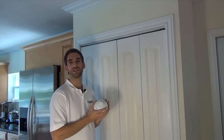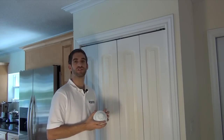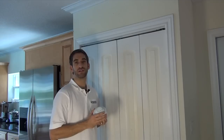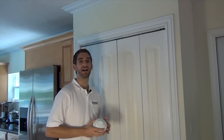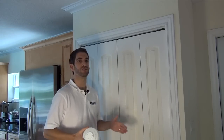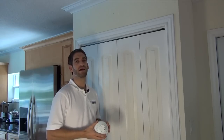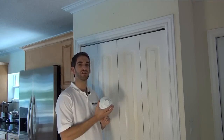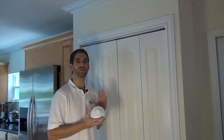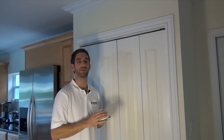The 5809 is a great sensor to use in the kitchen because instead of the 5808W3, which is a smoke and heat detector, this is a standalone heat detector only. Therefore, in rooms like the kitchen where you may have smoke when there is not a real fire, you're not going to get false alarms. So if you're cooking, you burn something, or you just open your oven and you get a lot of smoke, if you had a smoke and heat detector in the kitchen, you would have a lot of problems with false alarms. We always recommend for the kitchen you put a 5809. Some other good locations are commercial spaces and shops where you may have dust — again, another good option is to use a 5809 instead of the 5808W3.